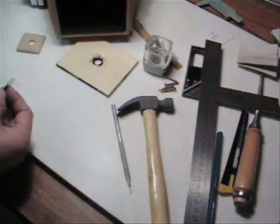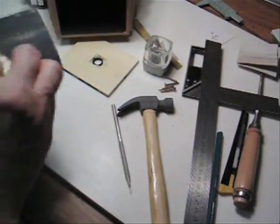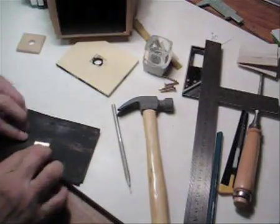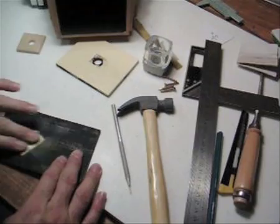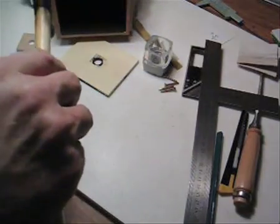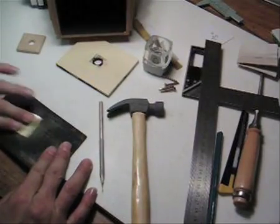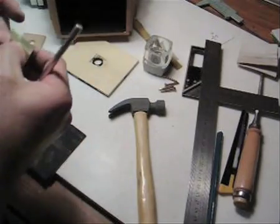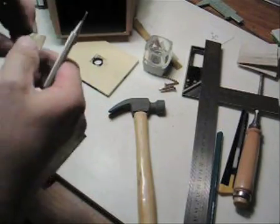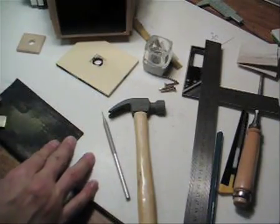Every time we do that, we get some wet-and-dry — very smooth sandpaper — and sand the back down flat again where the needle has pushed the metal through. Try to get that down flat, then go back and gently tap through that hole again. Once you do that and sand down the surface, go back to the hole and gently spin the needle through just to make the hole a little bit more smooth. Sand it and push any metal burrs out, then re-sand the surface again.